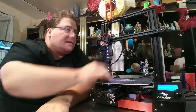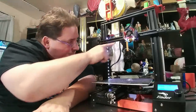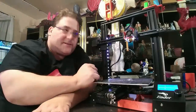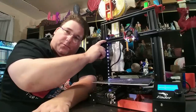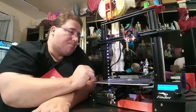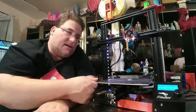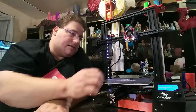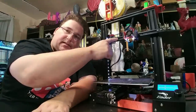It's holding bed level very well since I got rid of the trolley binding. I still haven't put my third hole in yet, but I plan to drill an additional hole through here into this plate so I can have three bolts holding it in place. By using nut and bolt I can go tighter, but bed level is holding good. I have not had to tweak or adjust the bed. I still do not like how much this bed moves — I don't like that rhombus four-point setup. It's not stable. If I push down hard on one end you can see the bed twist.